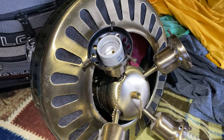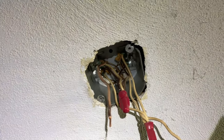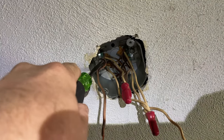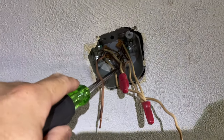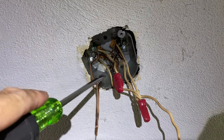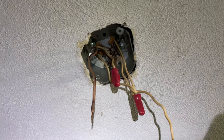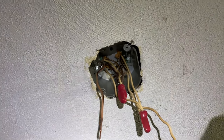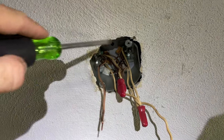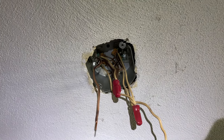So yeah, this is where my fan was. I have neutral wire and everything up here in the box. This is actually the wire coming from the switch right here — it's basically just completing the circuit at the switch. So what I need to do is get a line from here down to where my switch is. Since I'm adding a second gang anyway, it'll actually be easier. If you want to add one, you can just go up to the light switch and pull the wire down.